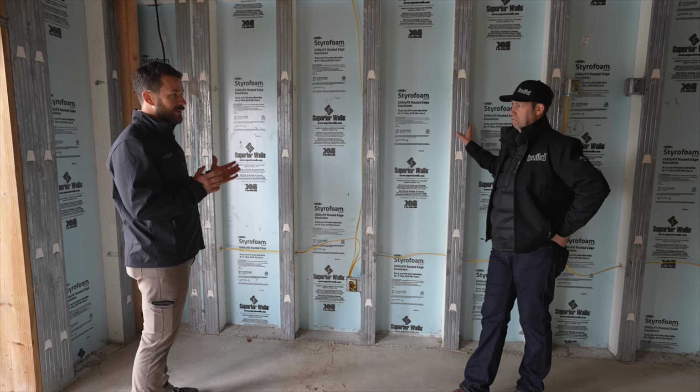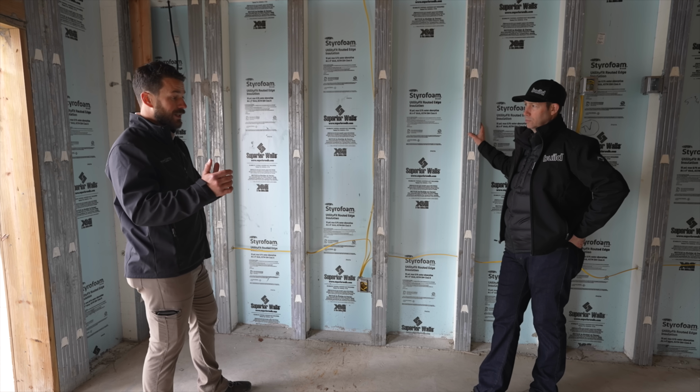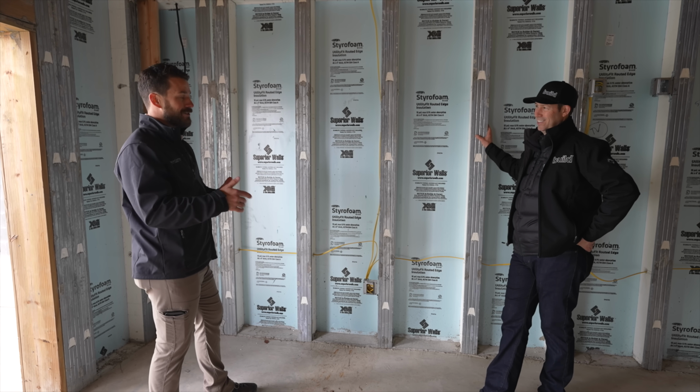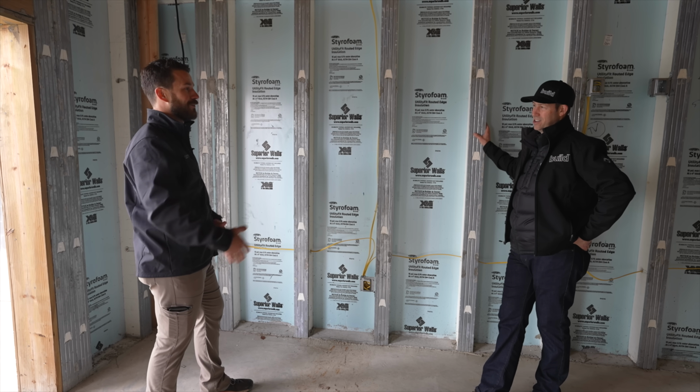So if you time it right, you can have it ordered and then plan your excavation. So in theory, Matt, you could excavate your basement on, say, Monday, Tuesday, have gravel on site Wednesday, their prep team's on site, and then they're setting the entire basement on Thursday in one day, and they're gone. And then you could be pouring your slab and framing basically the very next day.